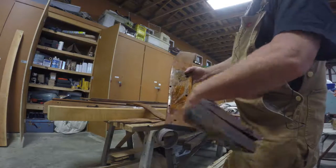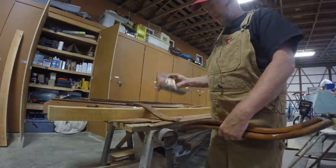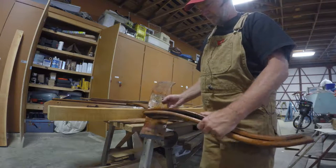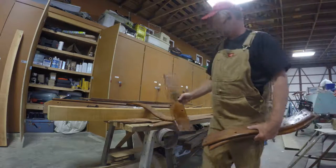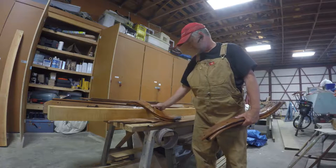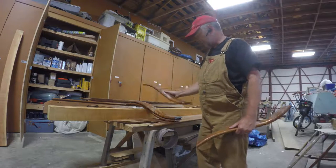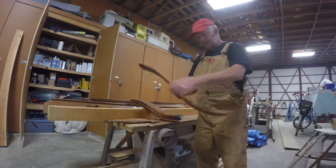This is where the boomkin beam passes over top, and I don't know whether weather or just what, but it was rough. So I put lots on there, and it's gone quite shiny, which I'm kind of indifferent to. I'm going to sand this down and put thickened epoxy on it, and then put it back on the boat.